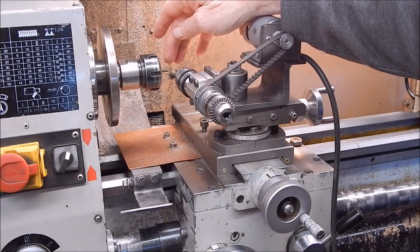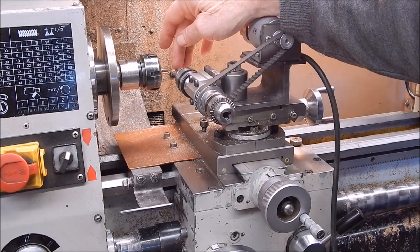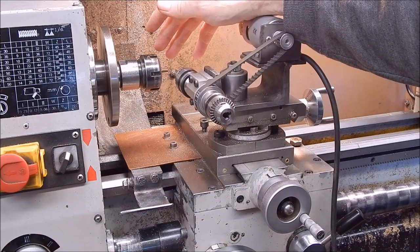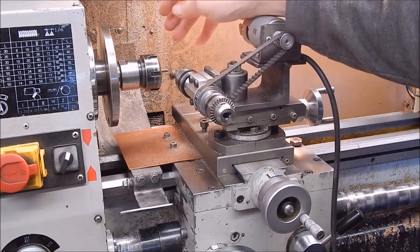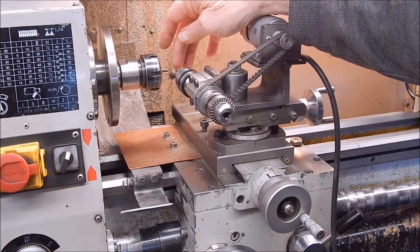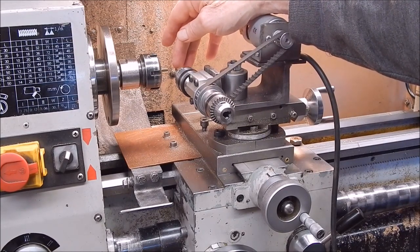So I had to make up a knuckle for one of the conrods to go in. And as you can see, I'm using collets. I mean, this sort of work, you have to use collets. It's just, if you want any sort of accuracy and no hassle, use collets. ER32. But what am I doing? Well, I'm milling this brass with a 4mm high speed steel milling bit.